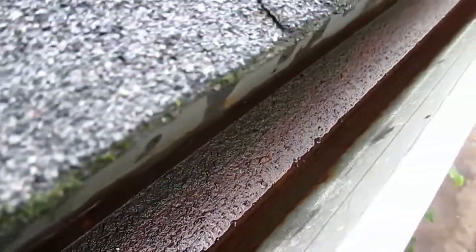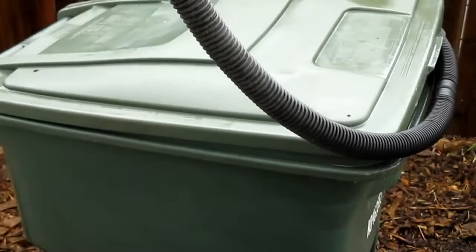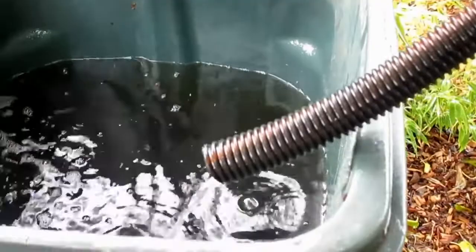As you can see, we've got a nice clean gutter here now. The next tip: even when you've got everything nice and clean, you still want to allow that first flush of water coming down the downspout to be diverted — at least 10 to maybe 20 gallons of it. You can use a separate container like a garbage can or a green waste container. This allows any residual dirt and contaminants on the roof and in the gutter to flush out with that first 10 to 20 gallons.